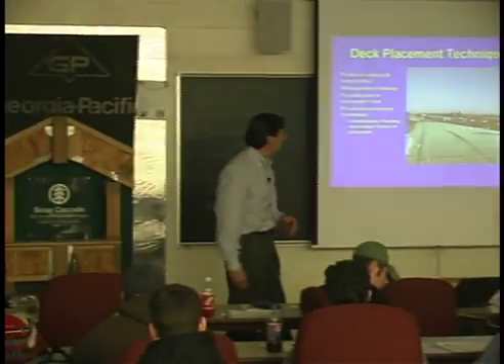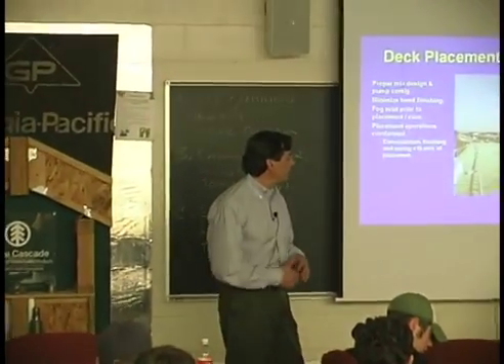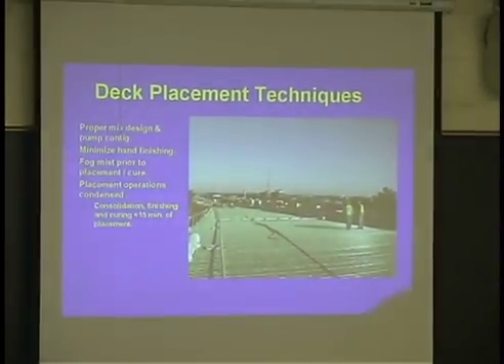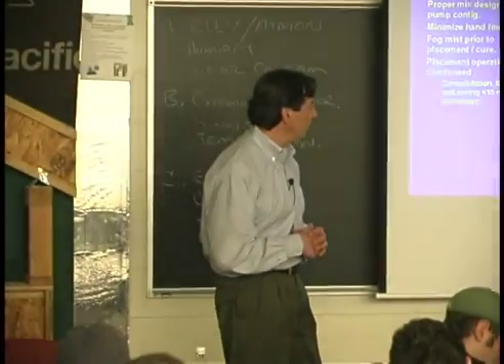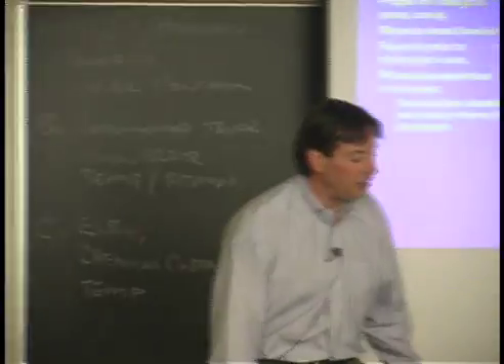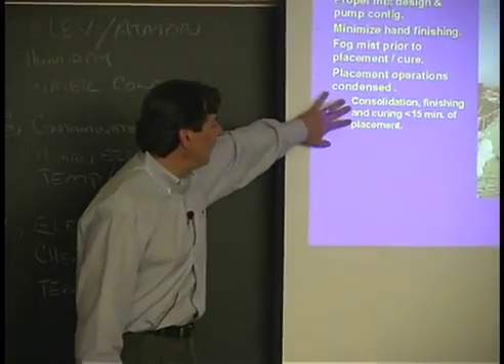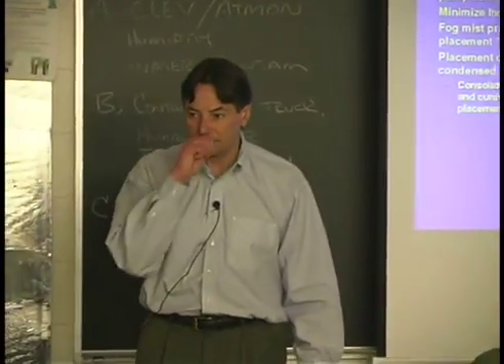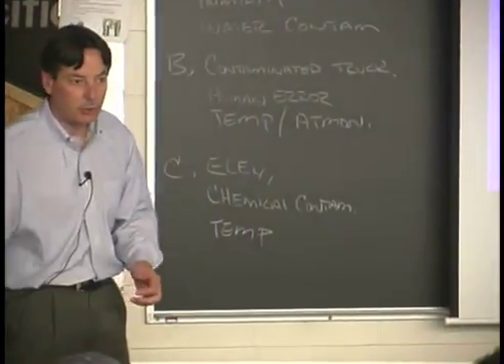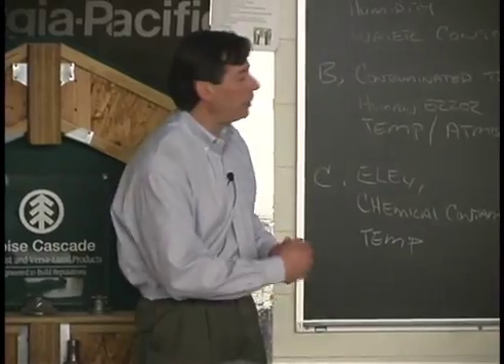This little video we'll play is actually the Chicago Skyway, looking north — Gary, Indiana is behind us. The bridge decks there were just repaired in 2003 with high performance concrete. This is a video showing their placement techniques that are a little bit different than what most people think of with concrete and bleed water. In this case, they're finishing and placing and having it cured within fifteen minutes after placement.